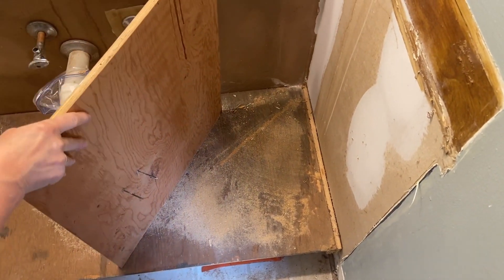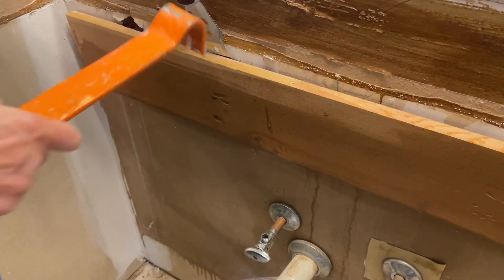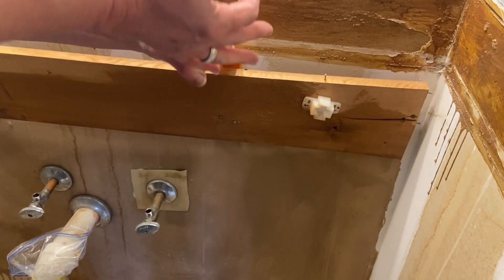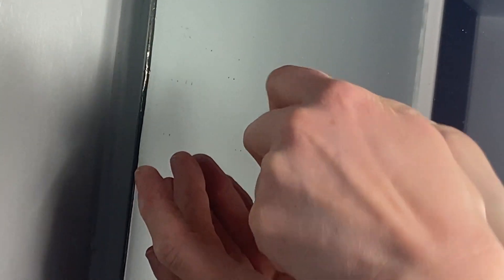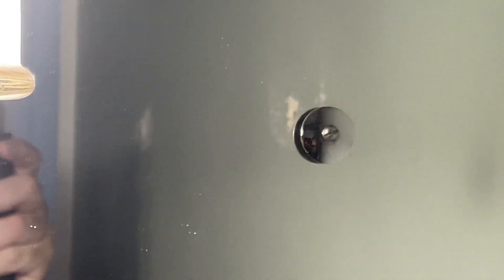Now that the side panel is out, the bottom is free. Watch out for the nails — where the nails are is actually where the studs are, so that gives us a little leverage. We now have the cabinet nearly clear with just one last nail in the corner. The 5-in-1 tool is really earning its keep today. The mirror is just attached with a couple of screws and some adhesive at the bottom — we hope they haven't glued the back, but in either case it has to come out.